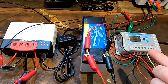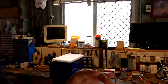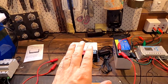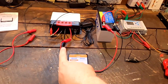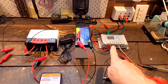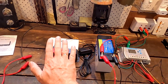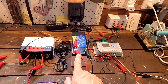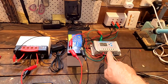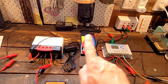This may take 10-15 minutes until these statuses are reached, but I played around with this setup this morning with completely different parameters and it still works totally fine. The only thing is the controller with the lower voltage settings turns off its charging capability first. As soon as we reach 14.4 volts this one turns off, so you lose all the energy from the solar panels connected to that controller. But this one keeps charging because it has the 15-volt setting. There's no problem having different charge controllers, even MPPT and PWM mixed.